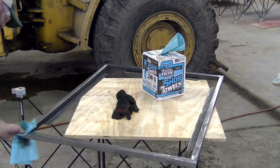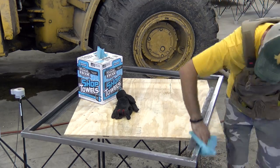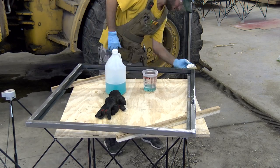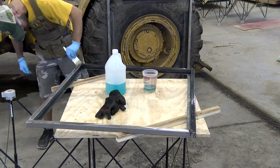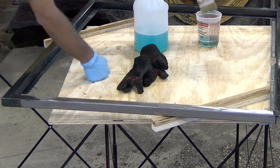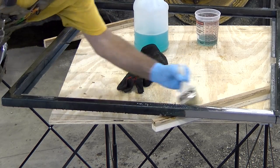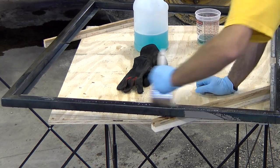With all the steel work welded up and ground smooth, we need to clean it off. We use brake cleaner and some shop towels to get all the residue off. Next we need to blacken the steel. We use a Jax blackening agent, which we purchased on Amazon — there will be a link in the description. Applying it is super simple: we just use a cheap chip brush and then wipe off the excess. You can see it causes an instant chemical reaction with the steel and instantly turns it black.